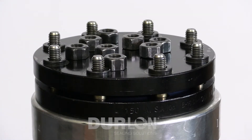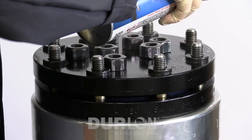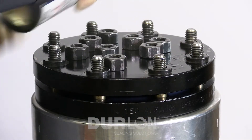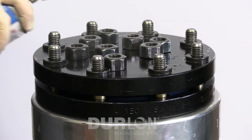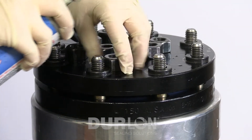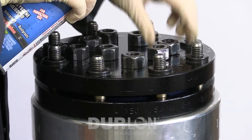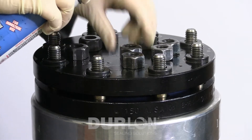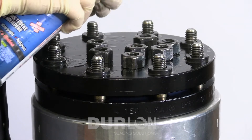In this case we have a spray lubricant for ease of use. What we're trying to do is lubricate any wetted part where you're going to have physical contact. Any part that has any type of friction whatsoever — you want to make sure that you have enough lubrication where you can literally see it from three or four feet away. There's never too much lubrication when installing a bolted joint.